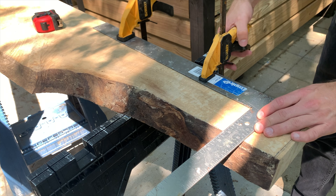Now that we've trimmed our slabs and built our forms, it's time for the fun part — mixing the epoxy. For this project I'm using Total Boat Thick Set Fathom, which you can pour up to three inches thick in one pour. It has a two-to-one mix ratio: two parts resin to one part hardener, mixed in a five-gallon bucket. I used Total Boat's epoxy calculator to determine volume, then poured in the first gallon of resin, one gallon of hardener, and a second gallon of resin for three gallons total. I mixed for around three minutes using a drill with a mixer attachment, keeping the mixer beneath the epoxy surface to minimize air introduction.